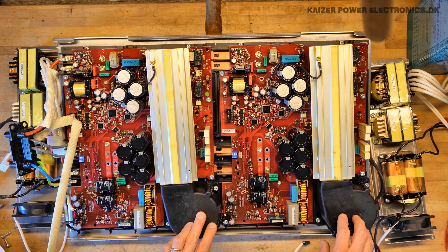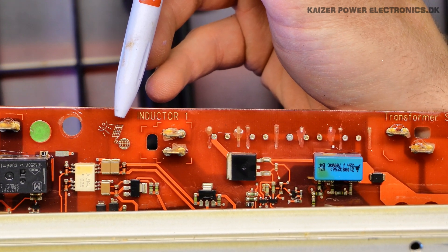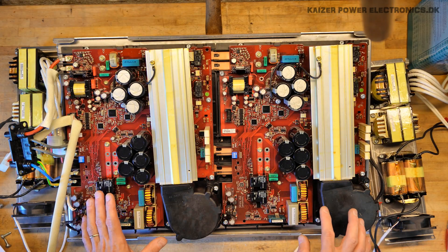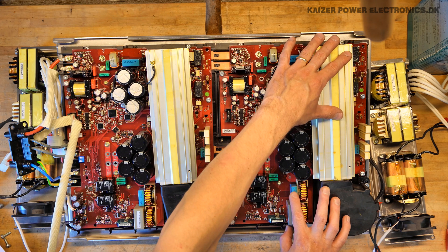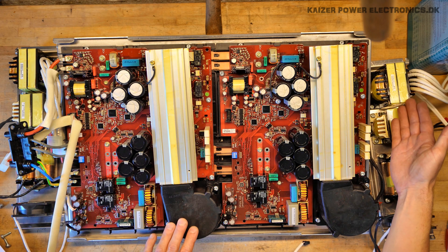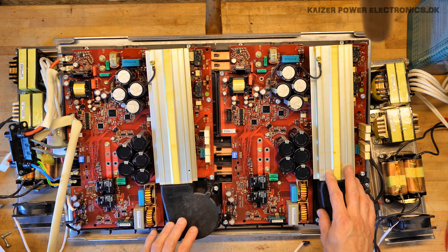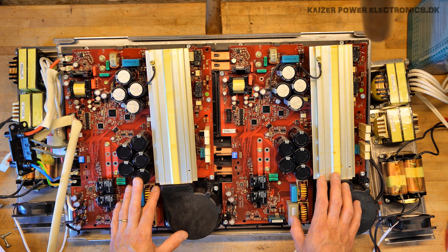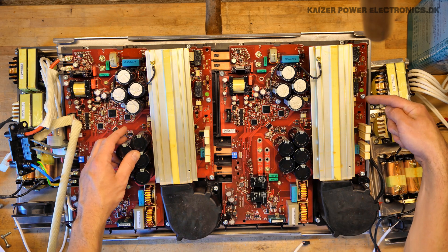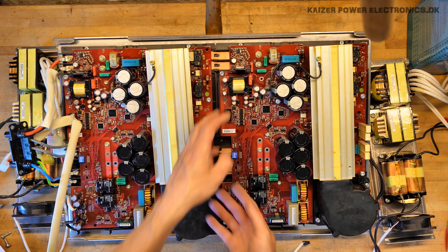Let's take a closer look at that. Just next to Inductor 1, we have a nice little pictogram of a sun shining on a photovoltaic panel, which then delivers a small electrical line down to a globe. The overall functionality is: we get DC in, it's converted to 230V AC and output through the isolation transformer from DC side to AC side. The AC side has two chokes or inductors. There are also a lot of optocouplers all around the board, giving a clear distinguished path between control logic and power electronics.